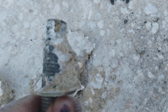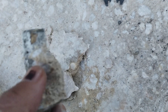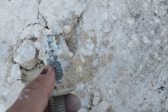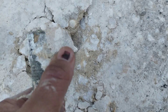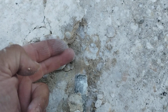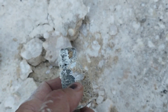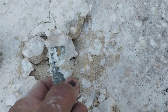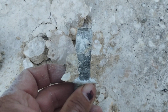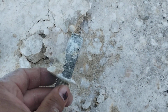There's a stone on this side — the ones that I drilled through, the epoxy bonded around the stone and that stone became part of the anchor. It was undermining the concrete from below — a piece of stone got epoxy on it and became part of the pullout resistance. The pullout force had to lift that stone up because it was bonded so well, and it would also have to burst the rest of the concrete, giving us a higher pullout rate.